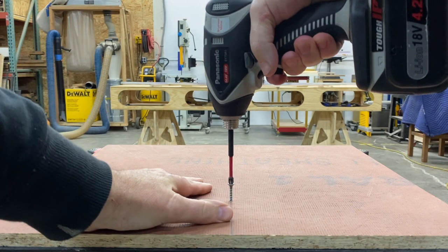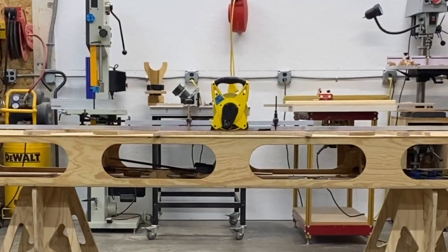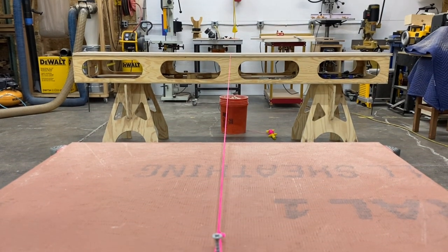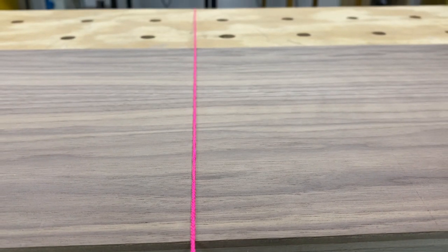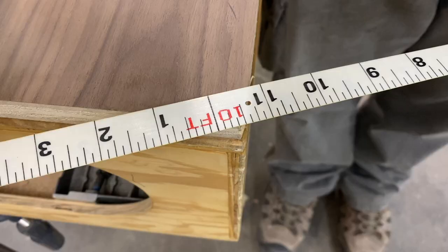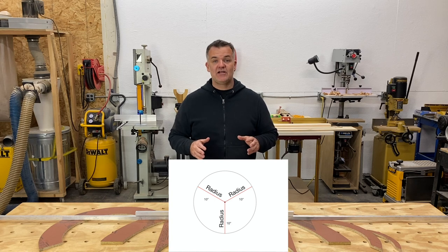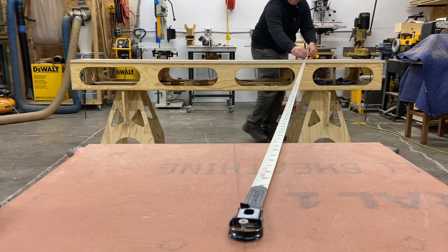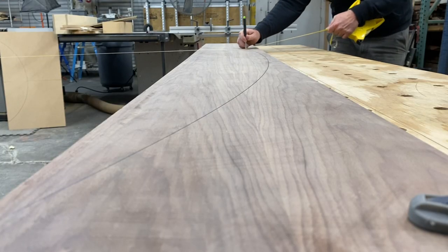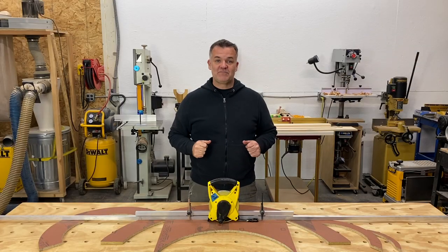Next, I'm going to set my pivot board on my work platform — which is just a piece of sheathing with a screw and a center line. Then place your pivot point at the right distance, attach a string to the screw, and using the center line on the pivot and the work piece, line the boards up. You can double-check your setup by measuring both bottom corners — remember, the radius is the same from the center to any surface in the circle. If the two bottom corners measure the same as the top, you are lined up correctly and you can draw your arch.